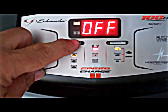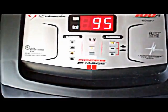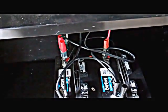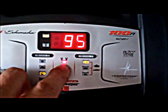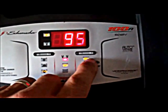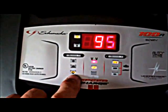I can put it on the rabbit, which is where it should be if you're charging — especially if you're charging two batteries — because on this particular charger that is 30 amps. And on a deep cycle battery like this, these are marine batteries, deep cycle batteries — you want to put a charge in them as quickly as you can. It's at 95 percent and it'll come up as it's charging. This shows it is hooked up to the batteries and that it's charging: standard lead acid battery, hooked up, cables hooked up, charging at the fast rate.